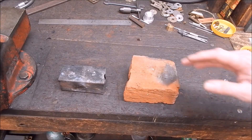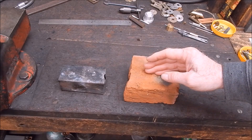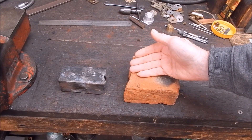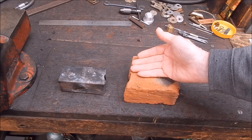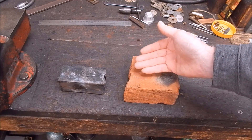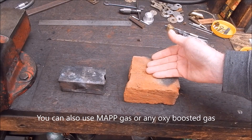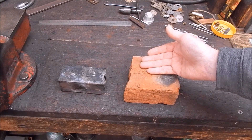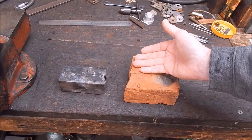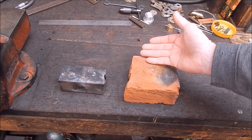There are various ways to make conrods - they don't have to be brazed at all. You can make them out of solid stock, but then you won't get that nice skeleton look and they'll probably be heavier. If you braze them as we're going to do using stainless steel, bronze is the practical choice. If you're making the whole conrod out of brass, you could get away with silver solder - the same stuff plumbers use on copper pipes. But if you use silver solder with steel, you need very high silver content rods, which are very expensive.